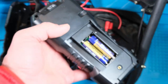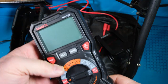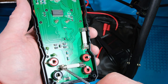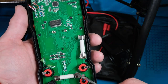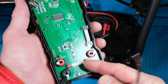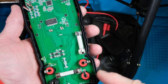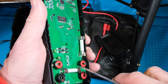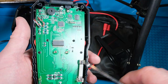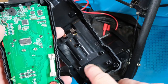When you snap this back together it snaps back and it's very tight and very rigid - no flex at all. Well-made meter. I kind of popped it back open again because I wanted to show you something. These fuses have little stoppers on the end, so if you were to drop the meter it's going to slide and hit these stops. Sometimes meters have plastic stops - the case that comes down and acts as barriers. The way this is designed, you got plastic around here, so there's really a lot of isolation with this fuse.